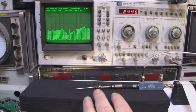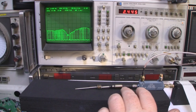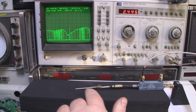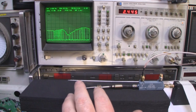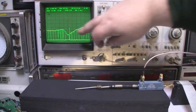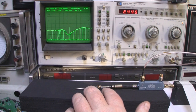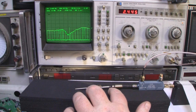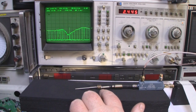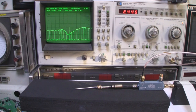So it's interesting, playing around with this, that I found that the ground plane balun here on the bottom fed dipole does factor in greatly the length of that onto the center frequency of the finished antenna, and also how the length of the main driven element here at the end seems to factor in more to the VSWR, although I'll have to hook this up to the network analyzer and do some more in-depth testing. But normally how this dip drops tends to indicate a better VSWR, and this gap here in the main driven element from the start to the start of the loading coil also factors in greatly to the frequency response of the antenna, more so than the end of the driven element here on the dipole antenna. And that's something that I never really knew previously.